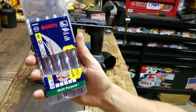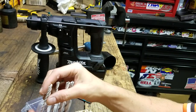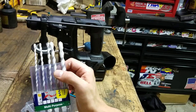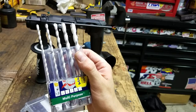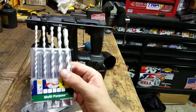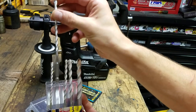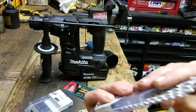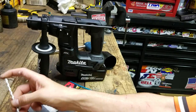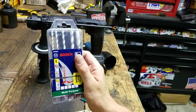They make these in a whole bunch of sizes. Also for drilling into concrete, I have this Bosch five-piece impact-rated Daredevil carbide-tipped masonry bit set — 5/32, 3/16, 1/4, 5/16, and 3/8. You wouldn't think an impact would do well with carbide-tipped masonry bits, but it works surprisingly well. You can chuck these into a regular drill with a hammer attachment, but you can also put them in an impact driver. If you just need to blast a couple of holes or set some blue concrete screws, they work great — the higher RPM of the impact does a lot of the work.